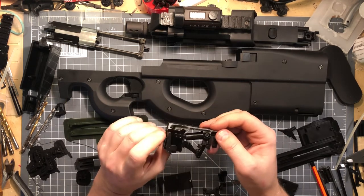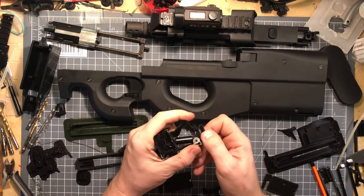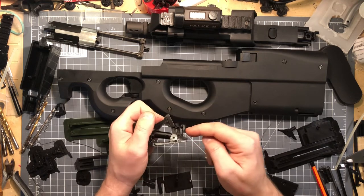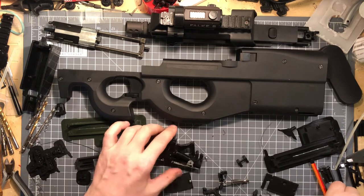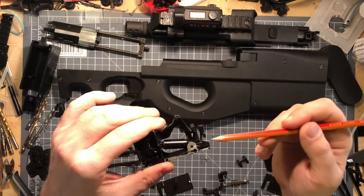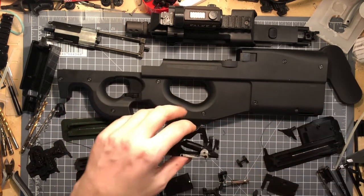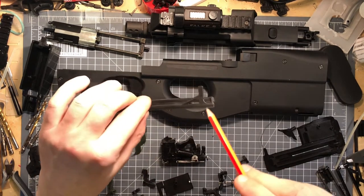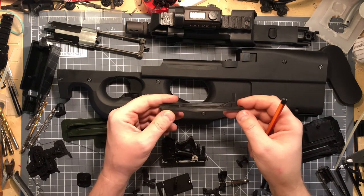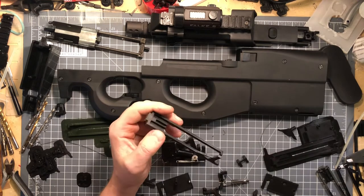So now this is printed — I don't know how long it'll last. I'll probably make some shooting tests just to check it. When this here in the back gets pushed up it releases — it's pretty simple. With this screw going in here you can actually set the point of how far the trigger goes back, and thus adjust how far back this trigger bar goes.